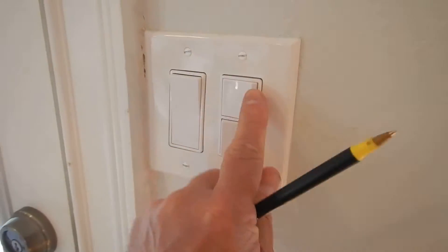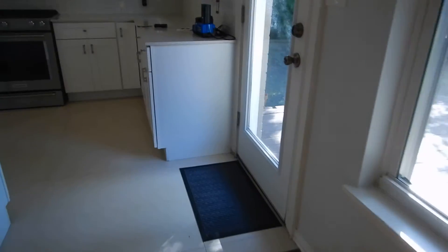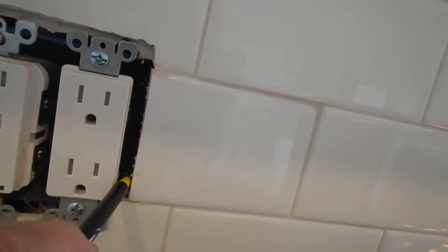When this house was framed out, all the outlet boxes were set up flush. So the receptacles and everything was nice and flush to the house. But when we come over here in the kitchen, we've added this nice splash back. When we did that, now the outlet boxes no longer stick all the way out. Now we have a gap right in here — it's a fire blocking gap, and it's been compromised.